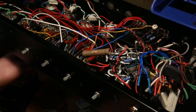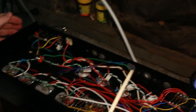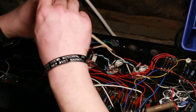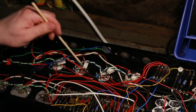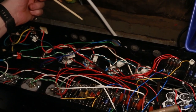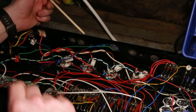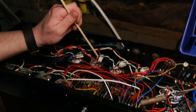Anyway, the next most silly thing that I've done: I was spending some time looking at my schematic, trying to understand what in the world could possibly be causing the weird behavior, when it suddenly dawned on me, the anodes all had a 100 ohm resistor on them. The anode in this case is right here, it's the pin 3. This is not a resistor for that, that's for my LED, but behind that, there's pin 3, this is pin 3, and this is pin 3. There is no 100 ohm resistor on any of those. Normally you do have an anode resistor, that's common in the circuits, but for whatever reason, in my translation from my schematic to my layout diagram and then my actual delivery here, I forgot them. I don't know if that's going to fix it, but what we're going to do right now is I'm going to go put some in.